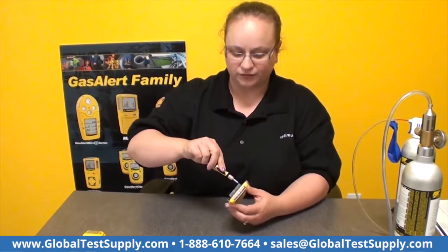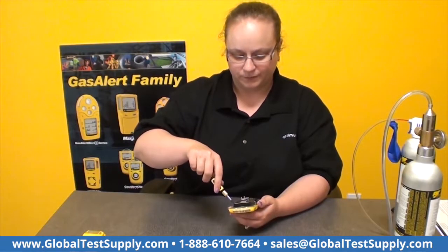Because the sensors are on the front side of the unit, it makes sense that the sensors to replace are on the front side of the PCB board. So same thing, 2 little screws, don't lose them. So now you should have 3 main pieces of your detector. This is where your screws are most likely going to fall out, so put your hand underneath them, because you're going to lose these 2 little PCB ones most likely. That one kind of stuck, but...